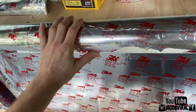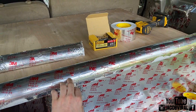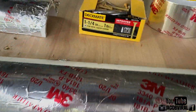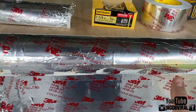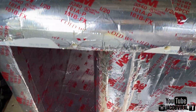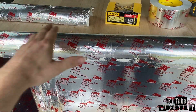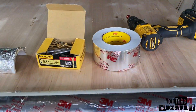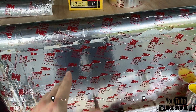Let me go ahead and work on this. What I did was cut this PVC to the length of my box — it's a really big box for a 10 inch — and just started screwing some screws into it and kind of made it work. The biggest concept here is to make sure this doesn't vibrate, and it allows the sound wave from the port to roll over instead of hitting a sharp edge. That gives you a different sound frequency response, and it also closes in the back of my baffle a little bit.